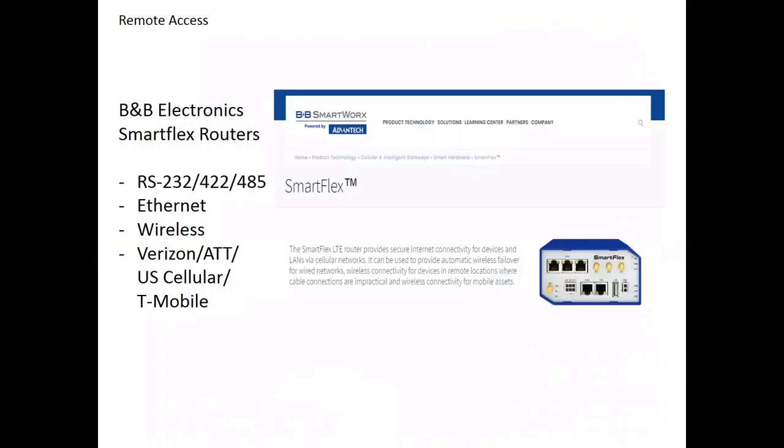The IS 1001 has an ethernet out, serial out, or USB out. The modems themselves can have multiple ethernet ports, a USB, direct serial port, and expansion ports which are RS-232, so you can assign as many ports as you need to one of these modems. You can expand this further by putting a switcher in.